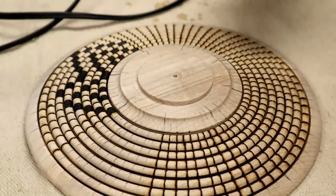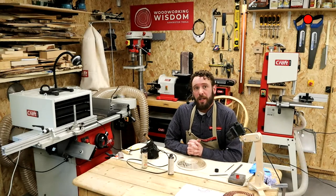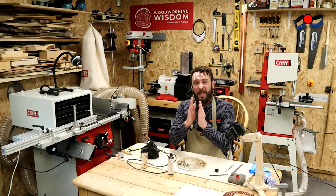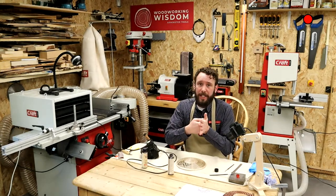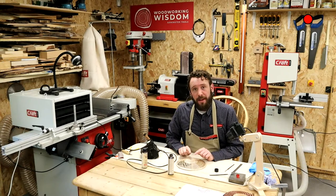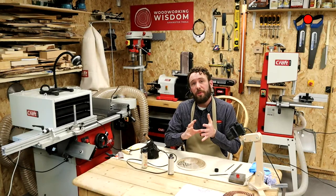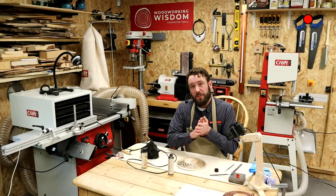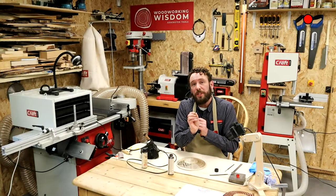Now overnight we had a question from Chris about the faceplate, and that he doesn't normally do up the grub screw on the back. Normally on the back of the faceplate there's a back boss, a piece of metal which brings the faceplate itself away from the spindle. It's important that it is tightened right to the back of the register on your thread of the spindle, so that thread really grips. Because we only have 36 indexing places on our lathe, Colwin rotated that through half of one of those indexing positions, and then tightened up that grub screw so that the faceplate is presented slightly off from the back of the register. So it's crept forward just a tiny touch on that thread.